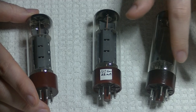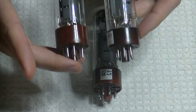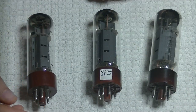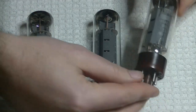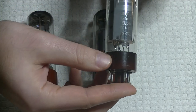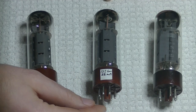We were once considering buying a large lot of new old stock Svetlana tubes, and the tubes offered had the double saucer getter but the spacers were the new sensor type. So either the seller was selling vintage tubes he knew were reissues, or he had been fooled. There are so many different versions of these reissued tubes, and some are incredibly close to the original in looks, but there are tells. The tube bases tend to be darker on the originals compared to lighter on new production.